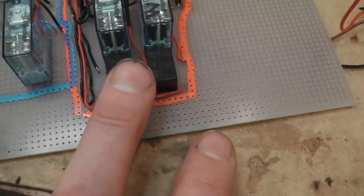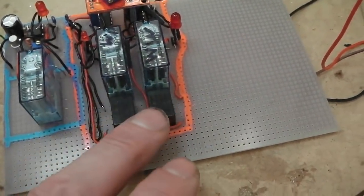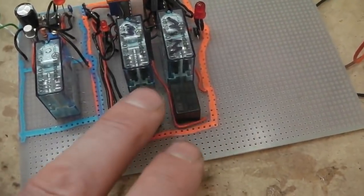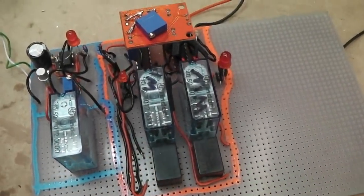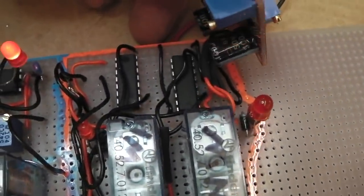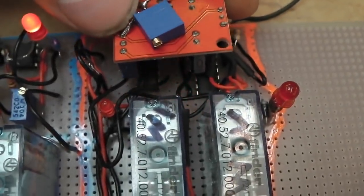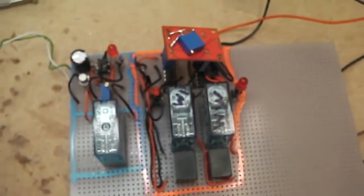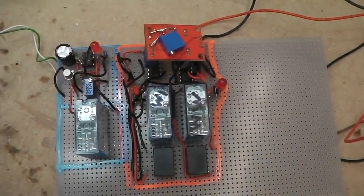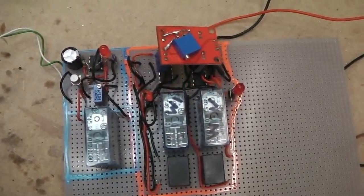If you are asking, there's two relays here. These are latching relays, part of the cycle itself. It latches on, does its cycle, then it delatches itself. It's a safety feature, a cutout feature. The chips that we use for this are just under there. We talked about them: a 4017 decade counter and a transistor array. That's it. That's my wash wipe module two-thirds built. I shall carry on building it now. It's the post washer motor wipe delay.